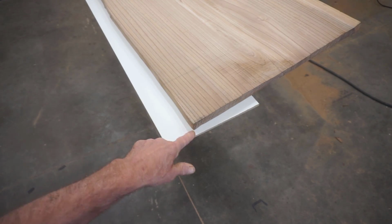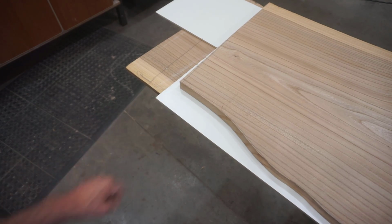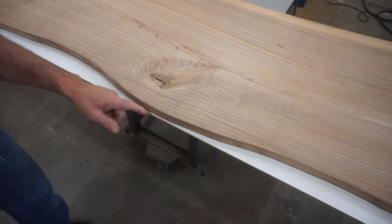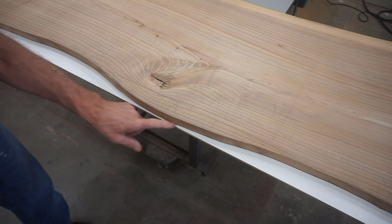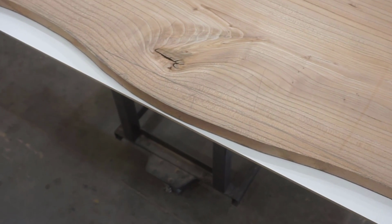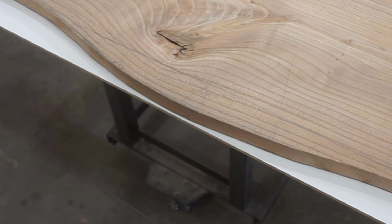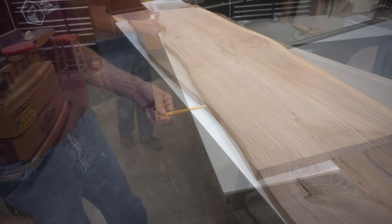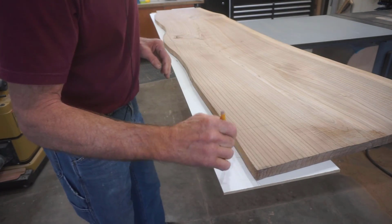Make sure there's a little bit of pattern extending by each end of the slab, and then I'm cutting away about the same amount of material at each end and keeping the biggest bulge as close to the edge of the pattern as possible. That keeps the pattern itself at a maximum width for stiffness and rigidity as I go forward. And a SharpWriter pencil gives me a nice fine line the entire length of this slab.